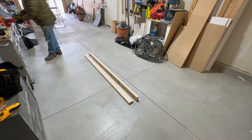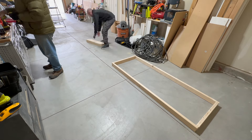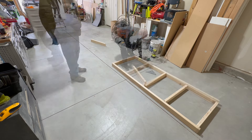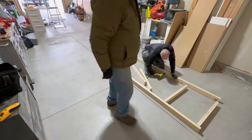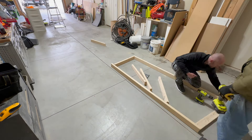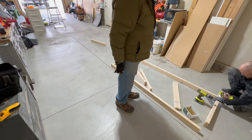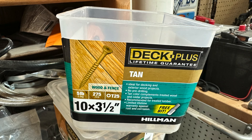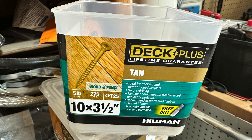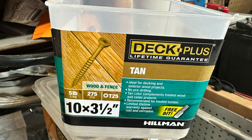With all of the pieces cut from my first box, I'm going to use my dad — a master DIY-er himself — to help me assemble these boxes. We're just going to line them up, make sure they are square, and then insert two screws in each place where the wood connects to the main post. To avoid splitting your wood, it's a good idea to assemble the box on the floor, mark where your posts are going to be, move them away, pre-drill your holes, and then drive in your screws. The edge pieces are most important, so I'm using a square to make sure the long beam piece meets up squarely with the short piece before I drill. The screws we're using are 3.5-inch deck screws with a T25 star bit pattern, which is really nice because you won't have to worry about stripping your Phillips head screws.